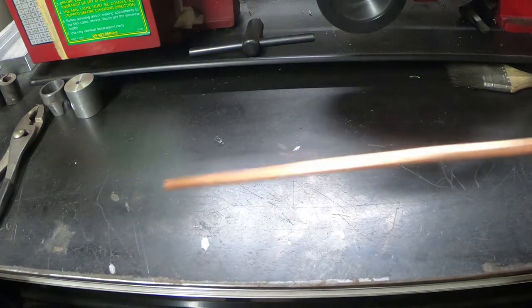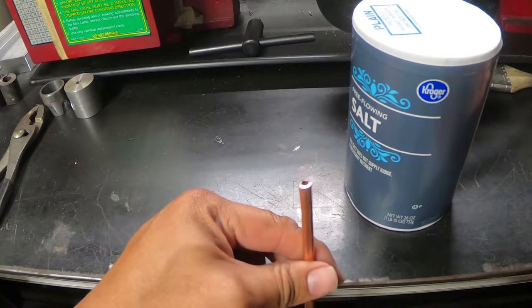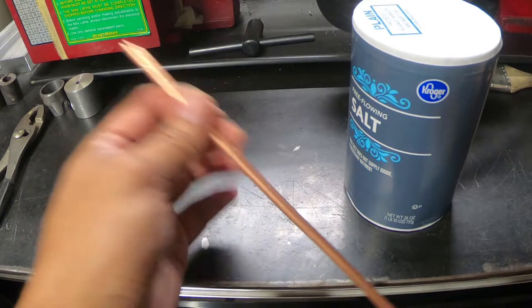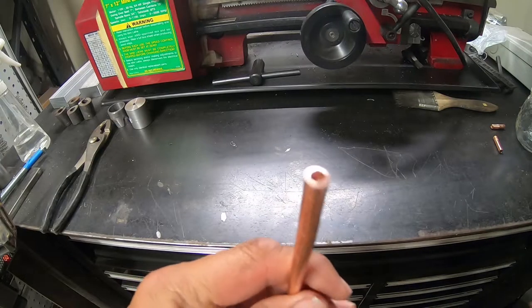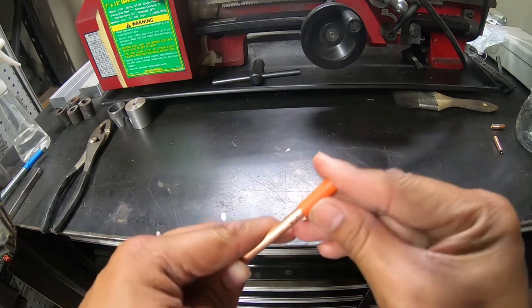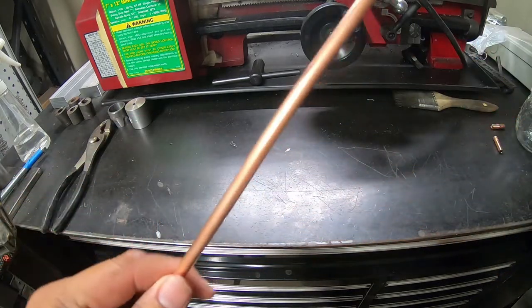Next thing is the salt. I was going to show the horrible process of filling this with a paper funnel, but actually just go ahead and pour the salt directly into the tube over the sink — it works a lot better and takes no time at all. Then cap off the end with that little orange cap the pipe comes with. If you lost it, try taping it securely, because this thing is going to be bent under pressure.